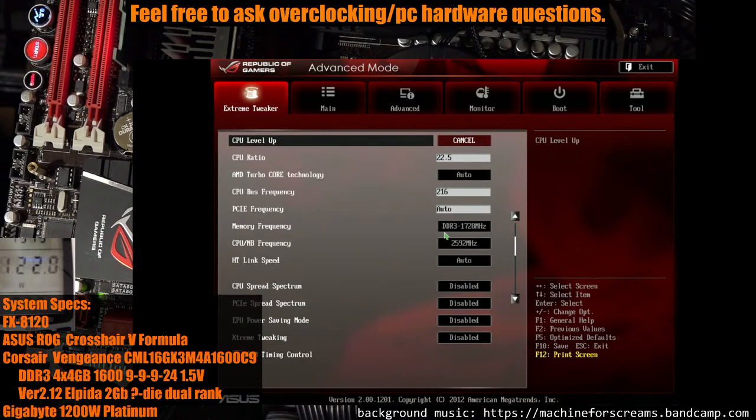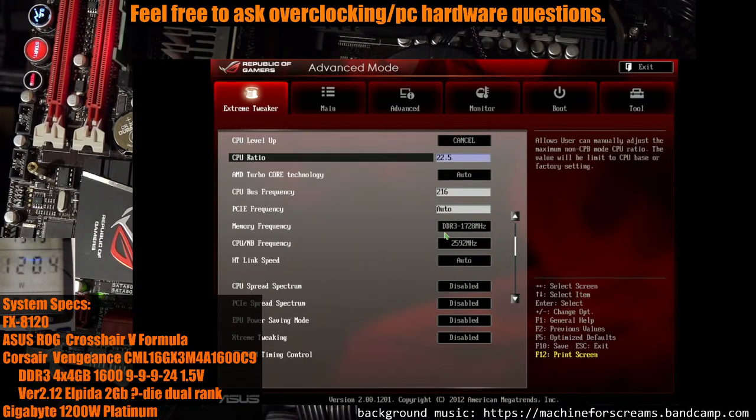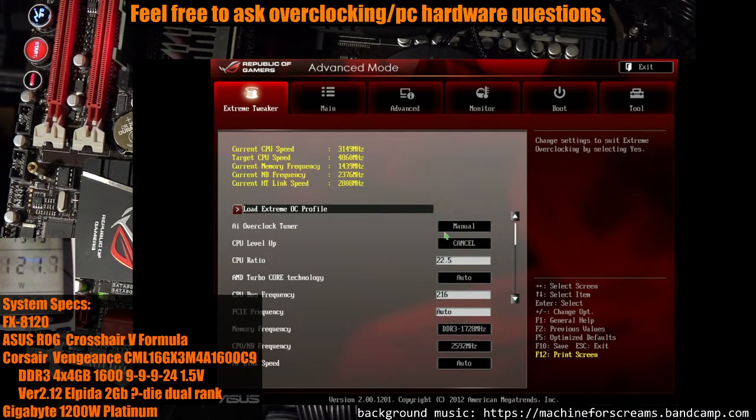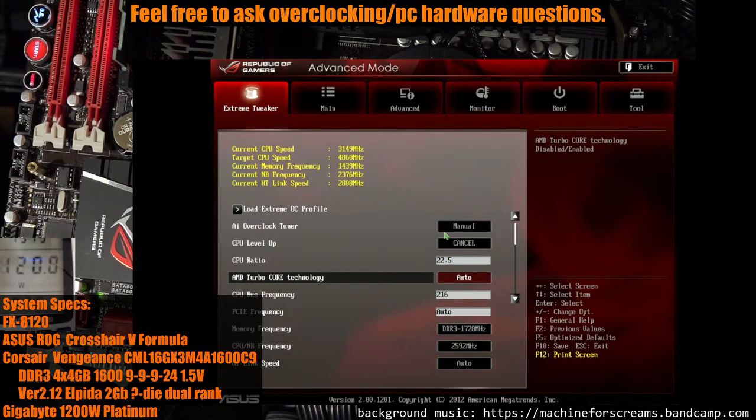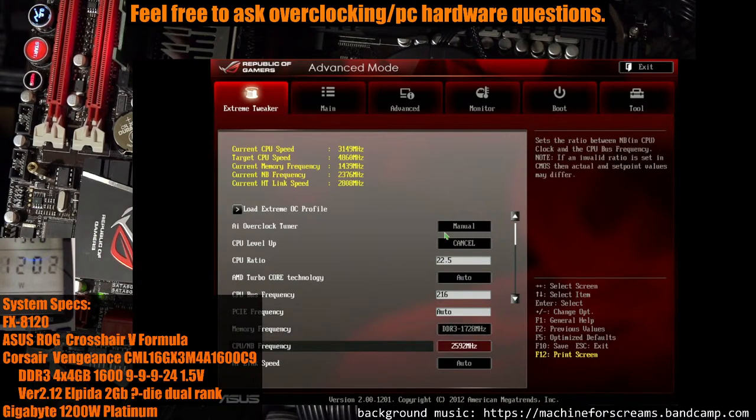Now, what's kind of crazy is that they kept using the Elpida branding for GDDR5 forever. And then when they finally switched to Micron branding, the Micron chips are actually good, whereas the Elpida GDDR5 is notorious for being trash. I can't think of a single GPU where I would be happy to see Elpida memory chips.